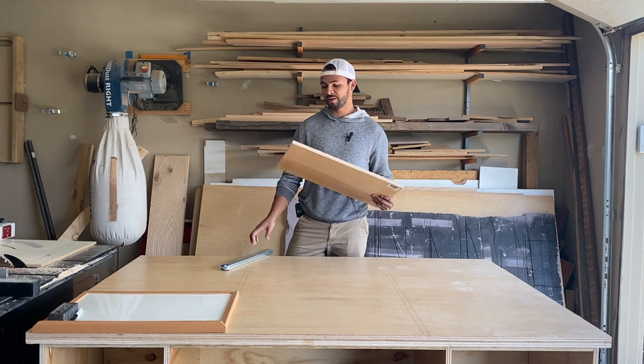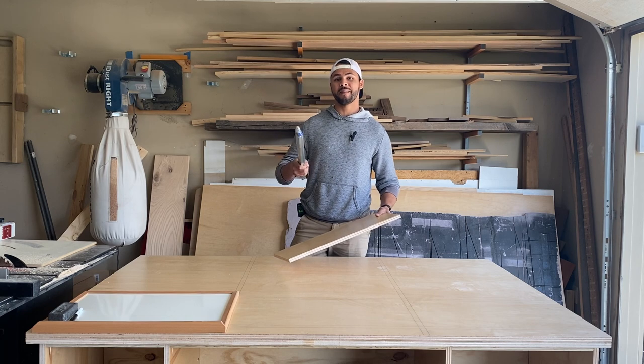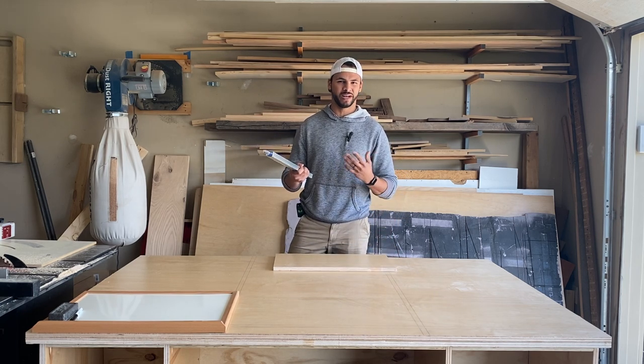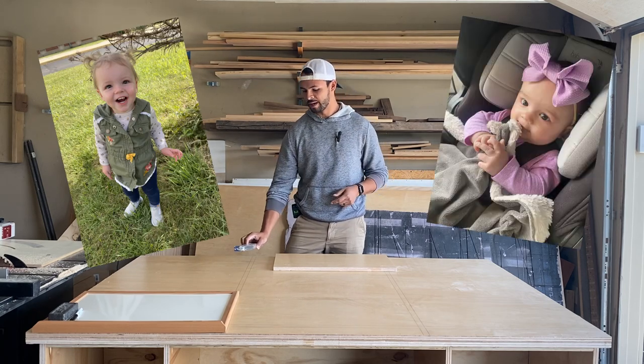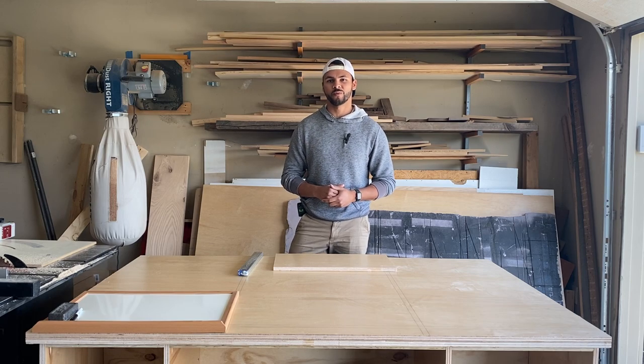In this case, we're going to use three-quarter inch material and half-inch drawer slides. These are soft-close ball bearing drawer slides. They mount on the side of the drawers. They're pretty nice. You don't have to do soft close, but the price difference is just worth having the fancy soft close and no smashed fingers for kiddos, which is important for me because I've got two little ones. So like I said, we'll show you three different ways. It's really not that hard. Stick around and we'll walk you through each one. Let's get to work.